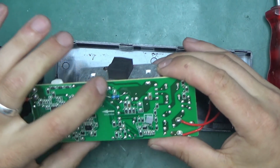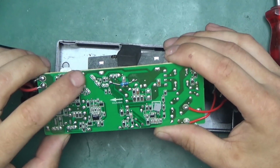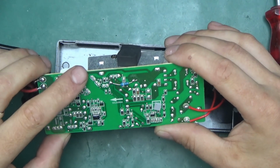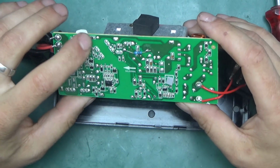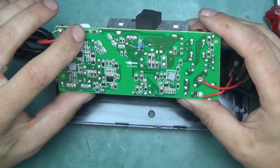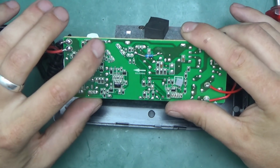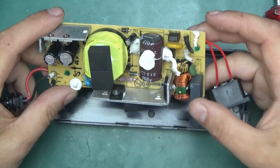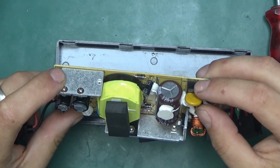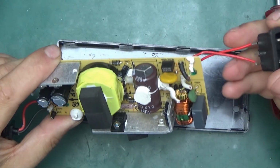There is one trace that goes across, but you can see it's a 226. Those are 22 meg resistors in series. This is just the ground connected from primary to secondary with a lot of those resistors in series, and those are in series in order to increase the voltage capacity so they don't arc over. Five of them, some common mode filtering for the input, a 6.3 amp 250 volt fuse soldered in. The only thing I don't like is those cables.